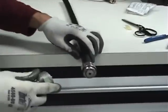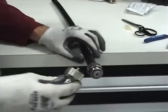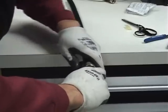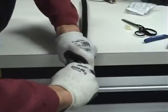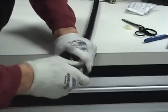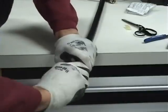Now it's time to place the connector head onto the cable. To do this, hold the back nut stationary while you spin the connector head clockwise. It is important to push the connector head against the cable and hold the back nut firm while spinning the connector head.